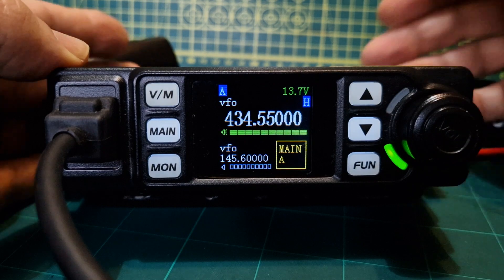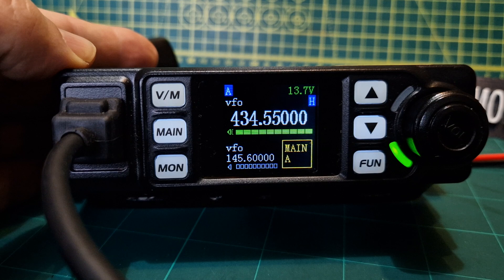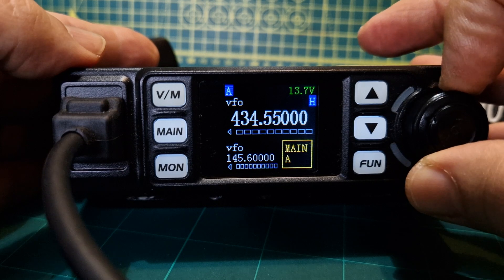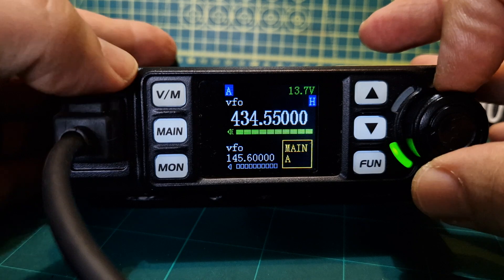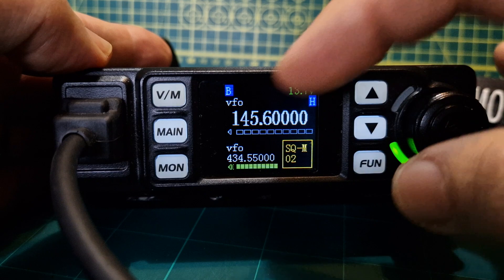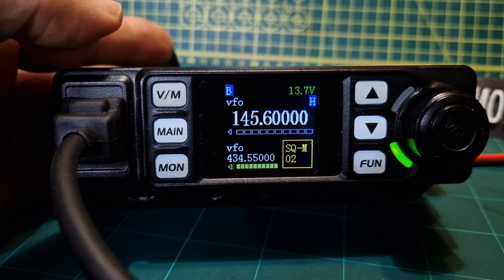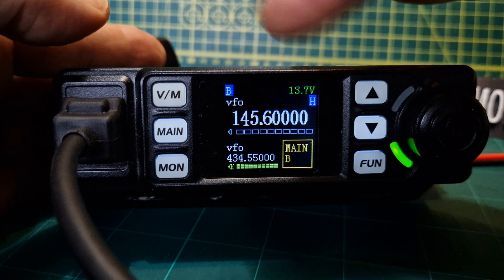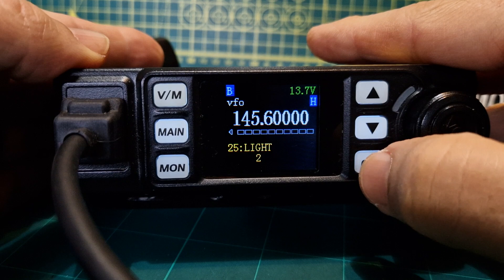It's a very loud speaker. You do have an external speaker connection — it just uses an SO-239. The power cable comes with a cigarette lighter adapter, which is quite handy. If we move that to the B band, because there's no activity on the A band, it will allow the B band to come through. If we get activity you get that dual watch effect and it works very well.